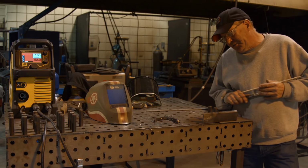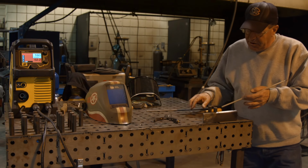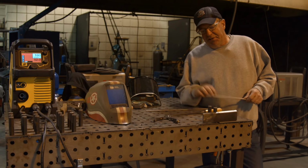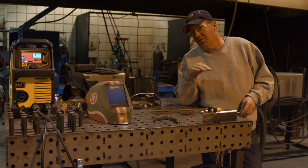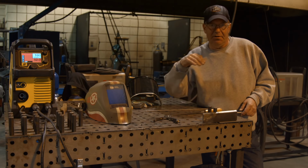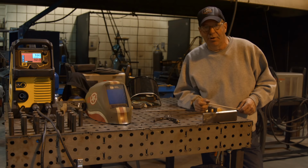There are other tests that we could do on it, maybe a hardness test, a Brinell or something. But again, you can feel this. It gives you a good indication that we're not going to get into it. What could we use this for? Imagine this: how many times do you sharpen your lawnmower blades during the season when you're mowing? If we went in and put this on the bottom side of our blade, and didn't do anything to the top side, the soft top material is going to wear away. It's going to sharpen itself all summer long. Think about that for a second. That would be one simple application that we could relate to.